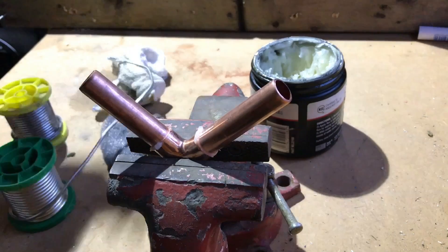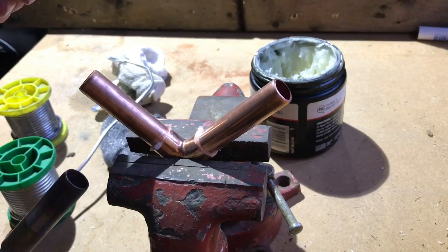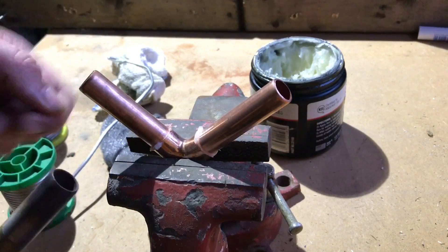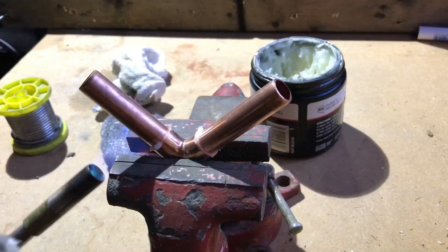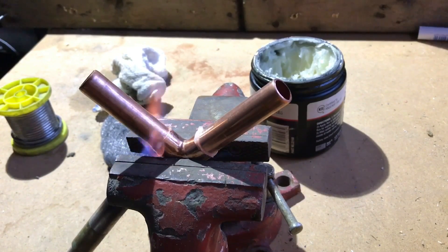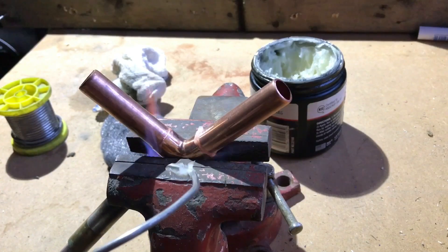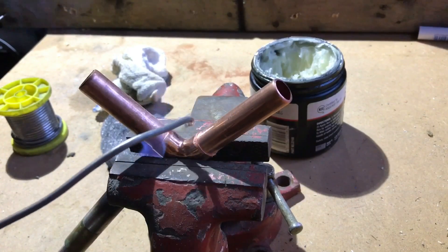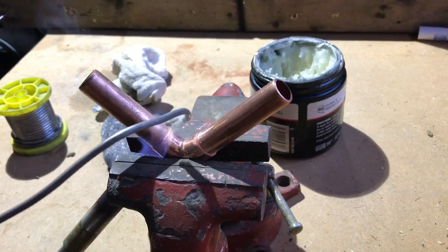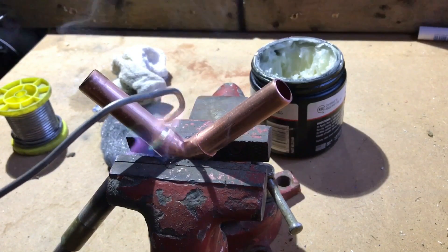So we're going to apply the torch from this side of the fitting and apply the solder from this side, and let it run naturally. Once it's run, make sure you cover the entire circle of the fitting. It only needs to be on low — as you can tell it's not very loud. We're applying from the opposite side, trying to get the first half of the fitting and letting it run onto the second side as well. Also keep a little bit of flux on this side of the solder so it helps it run. As you can see now it's starting to run — there we go.